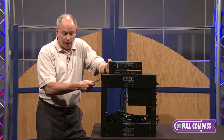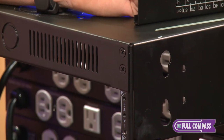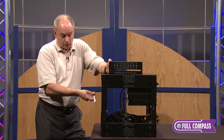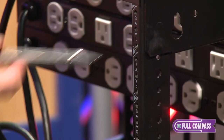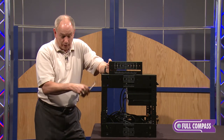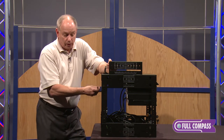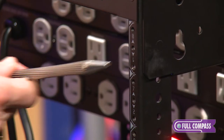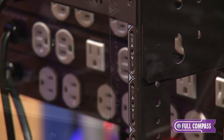The top of the rack has a 1U spacing with no numbering. In this case we're dealing with an 8U rack, so when you get up to here it's 8, and the inverse number is 1. If you went over on the front side reversed, it would be 1 up through 8. If I want to cut this down to 6U, I would make my cut at 7, because I'm going to be hiding 1U to net me 6U.